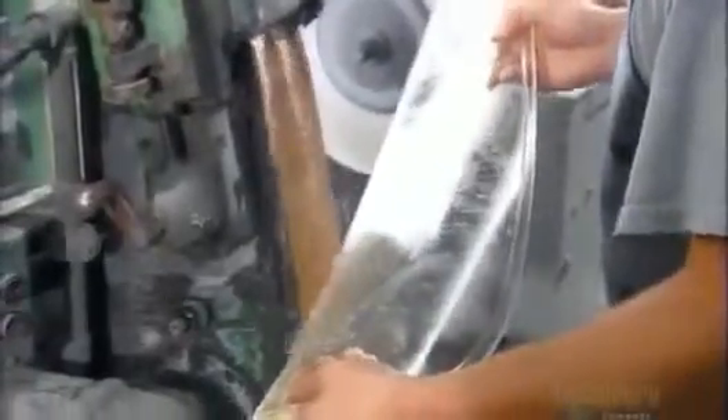In the factory's finishing shop, they use a diamond saw to slice away excess glass around the periphery. A special sanding belt is used to smooth the surface to perfection. Then, with a cloth buffing wheel, they polish the glass to a shine.